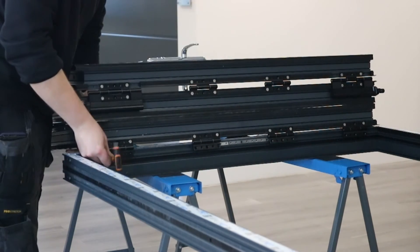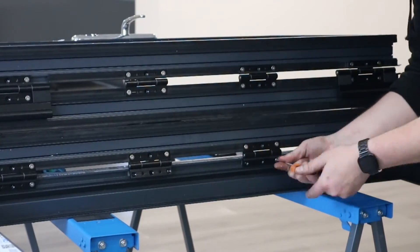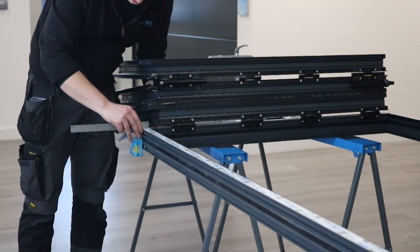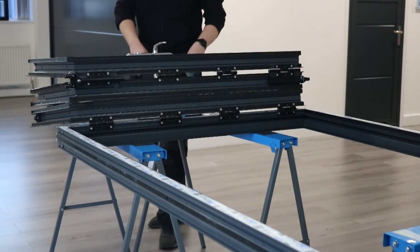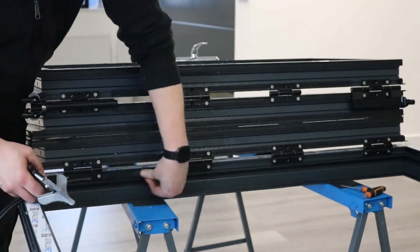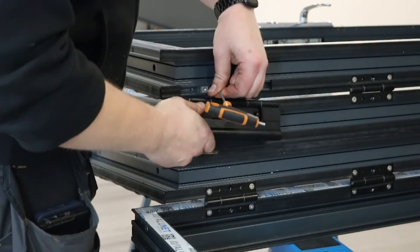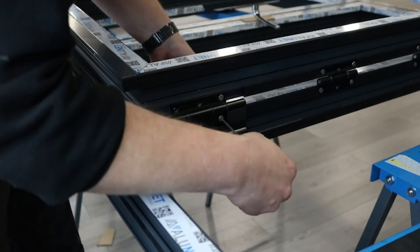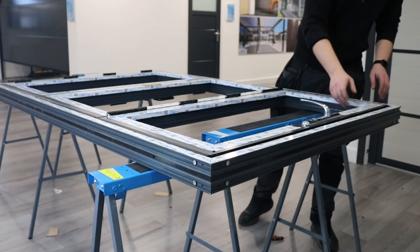Lift all of the sashes into the frame and fix the hinges loosely. The sashes should be fixed approximately 31mm from the outside edge of the frame to the gasket on both sides so that the sashes are equal within the frame. Once these measurements are correct, you can fix the hinges firmly into position. Apply a gasket in between each hinge. Remove the wheels, fold the bifold into the frame, and replace the wheels before closing the traffic door. Screw the keeps and rebate to your traffic door and your bifold is complete.